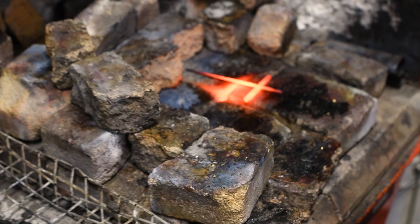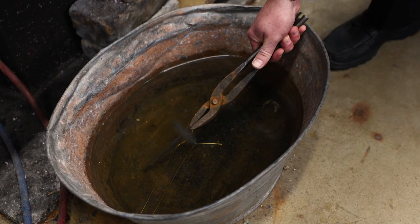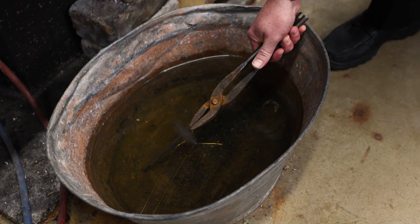The gas torch is put back into the tube for safety, and to cool the piece of metal, we take it with a pair of tongs and quench it in a bath of cold water. If the join has not worked, we can reheat it — the brazed rod will remelt and we can separate the two parts of the steel. We will then need to clean them up, probably by filing or with an emery cloth, and then we can rejoin. Thank you very much.